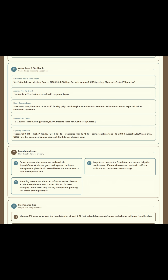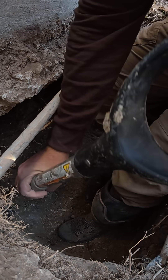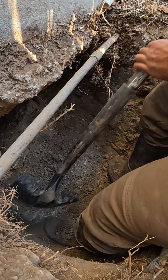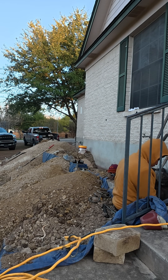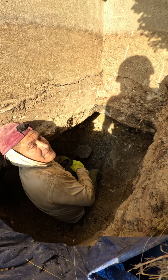The data showed rocky soils and limestone deep below the house, and once excavation started, that information was confirmed in the field. We excavated the exterior and tunneled under the home to reach the interior beams.